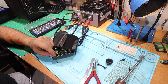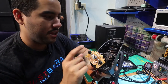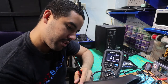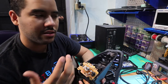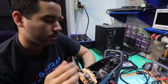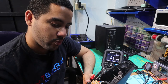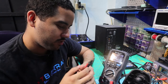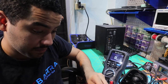I'm just taking out this circuit board from behind. So I'm going to test the button on the main speaker. Because if this button here isn't working then that's the whole problem, but if it is then the problem will most likely be inside of the subwoofer or the power unit, which is another headache on its own. So I'm putting my multimeter here in continuity mode, so when I press both together it makes a beeping sound. Hopefully this is the problem.